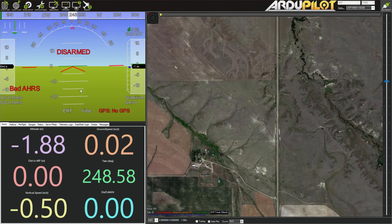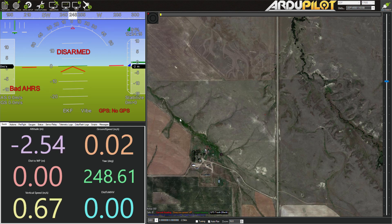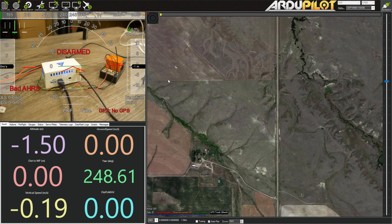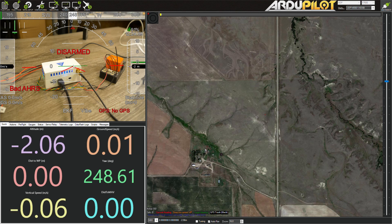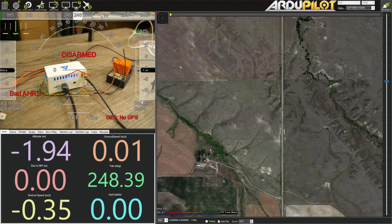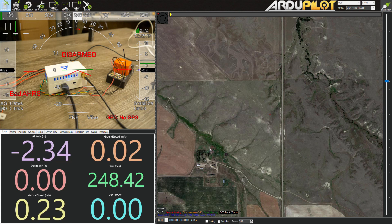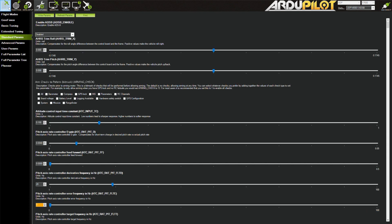To demo this in Mission Planner, you simply set up the streaming options as found on the Sky Drones website, and once connected it will synchronize and the video will appear over the back end of the HUD. Just like any streaming device in Mission Planner, you have live video over the heads-up display, can pop it to full screen, adjust the size, and still have all of the usual telemetry options as you would with a normal telemetry link. Because this system has no RC you still need a separate RC control link, but it gives you full Mission Planner functionality to control your autopilot, change parameters, and have your video in place.